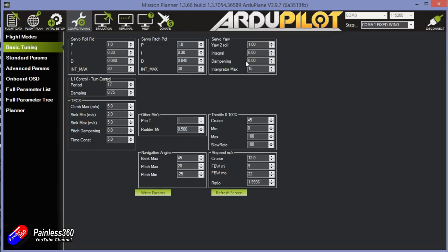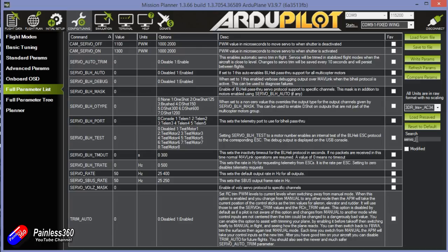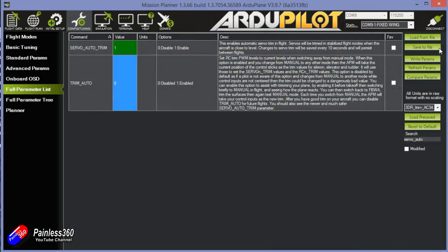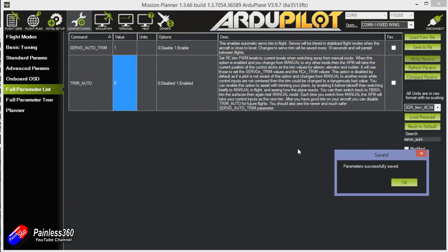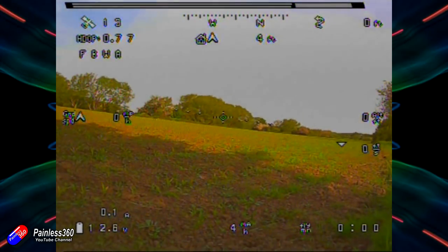The other thing I'm going to do while I'm in here — and I mentioned this in the maiden video — is turn on the servo auto trim. This is a cool little feature in ArduPlane. It figures out what the servo trim needs to be and saves that every 10 seconds. Whereas with other airframes you've got to trim manually and incorporate trims into the flight control software, you can just turn this on and leave it on. It means that if you flip back into manual mode, the servo midpoints needed for straight and level flight have all been figured out for you.